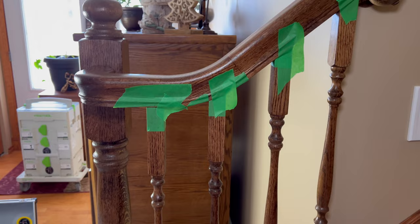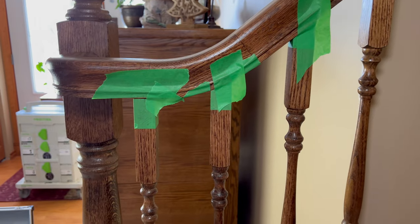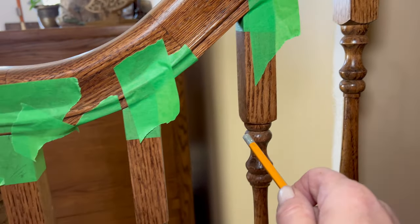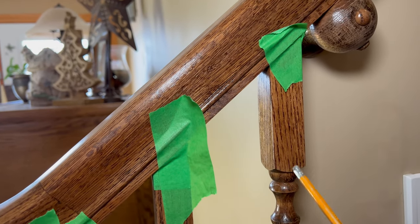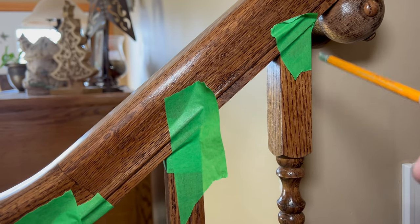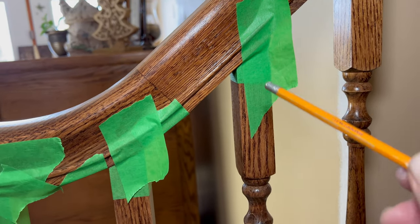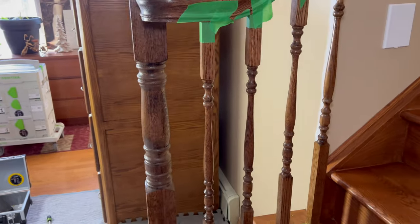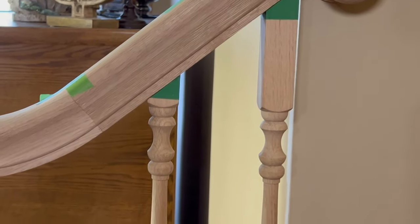One of the things you've got to remember is when you do these kinds of balusters with a contour on them, you have to have the balusters follow the slope of the stairs. So on our first stair baluster, we cut a 41 degree angle on the top, and we measured that distance there, which is like 5 1/4 inches or so. And all the rest of these balusters have to have that same top 5 1/4 in order for it to look proper. In other words, if you just cut off the top on each one, it'll be all messed up.